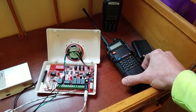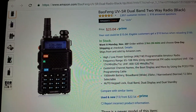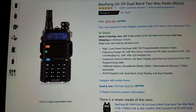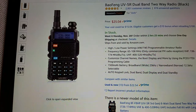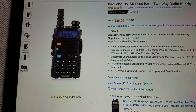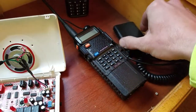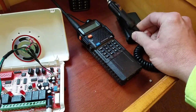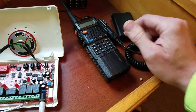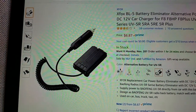I'm also using a radio in this project to transmit the audio output — a Baofeng UV5R. They're dirt cheap, about $25 on Amazon. You do need knowledge of how to program radios; you cannot just put any frequency in. You need licenses for certain frequencies or you need to be a ham radio operator — research that before proceeding. I'll be using a battery eliminator instead of the battery pack, hooking it to a 12-volt DC power adapter with a couple of amps so the radio can run 24/7 without worrying about charging the battery. The battery eliminator is about $6.87 on Amazon prime.